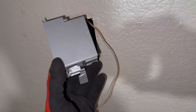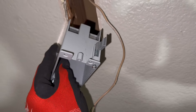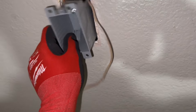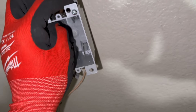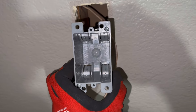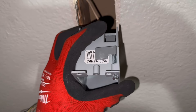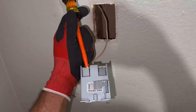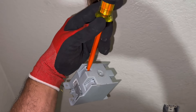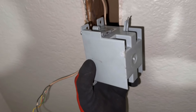We can start working on installing the new gang box electrical outlet box. There are different boxes you can use. These specific ones have a clip or wing on the back — as you put these inside the wall and secure it, the wing opens up and starts to secure to the drywall. We're going to have to feed a wire through, so you'll need to open the clip on whichever side the wire is coming from — left or right. Insert your screwdriver onto the back end and push the clip up to feed the wire through.